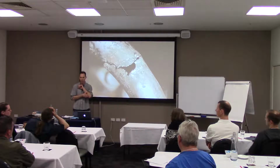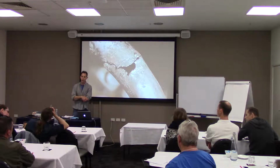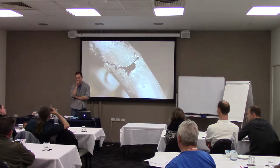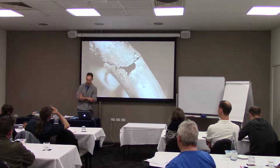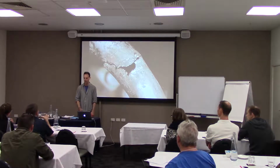There's also a detinning bath that I read about from saxophone makers when they throw the saxophone bodies in after they soldered all the posts off. If it's in there too long, it can create hair cracks on the end of bells and stuff. Think soprano sax body, you have that bell here where there's a bit more tension, and you get hairline cracks when it's too long in the detinning bath. True. And there was a guy from Michigan who came to work for me, and he said, "Oh, there's an old fellow, and he uses one of these baths. It just removes all the solder." And I'm like, "Well, that's no good." He goes, "It was like magic." And I'm like, "Well, what's it doing to the base metal?"